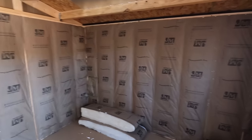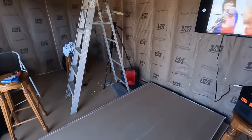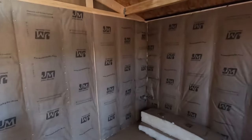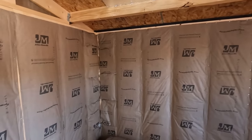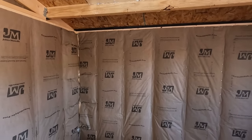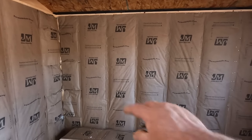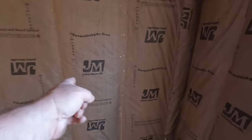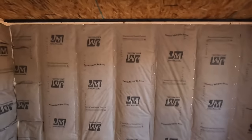I'm gonna start on this wall here. I'll be shuffling all this crap from one end to the other. Normally on a wall you'd start on the top, but with my bad back I'm gonna start putting pieces on the bottom. This is 10 feet, so they're gonna come out 8 feet and leave a 2-foot strip — so I'll put these horizontal, then put that last strip vertical. It's about 6 foot 3, probably closer to 7 — gotta measure it again.